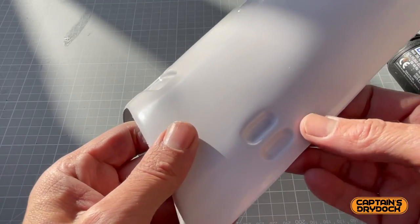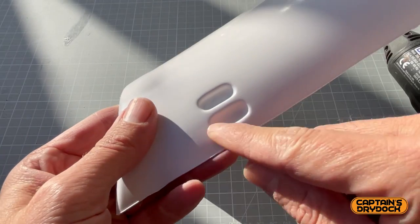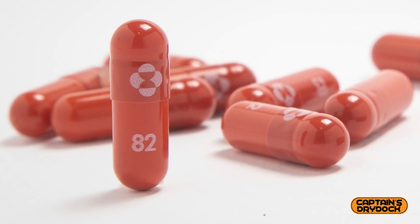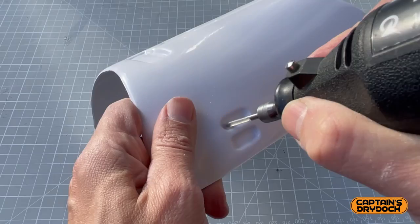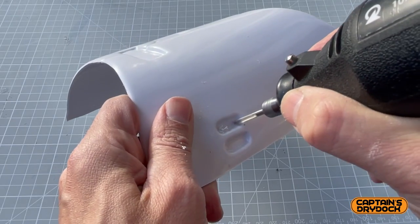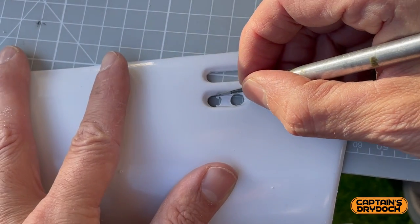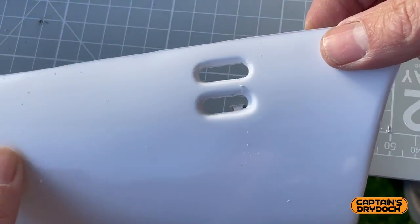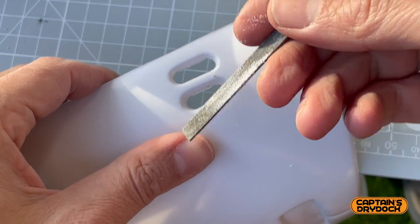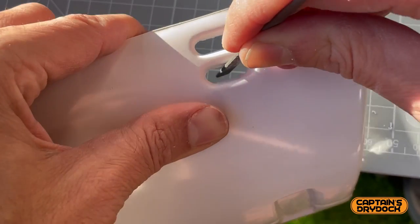At this stage I'm going to drill out the pill holes — they're probably called pill holes because of their pill shape. I'm going to use a combination of a Dremel and needle files to make a perfect hole. Once I've made the two holes I'll get my scalpel and cut out the middle bit, and once it's close to looking perfect I'll get out the needle files and clean up the edges.